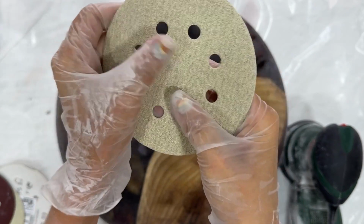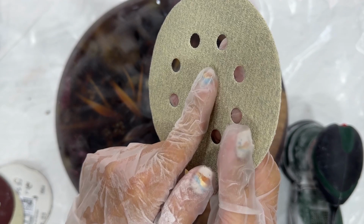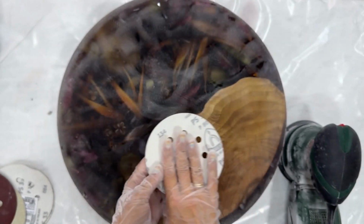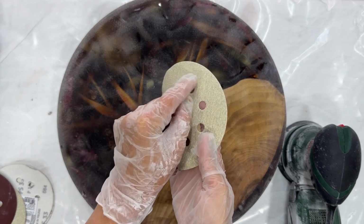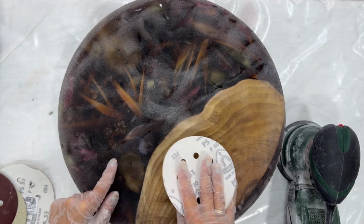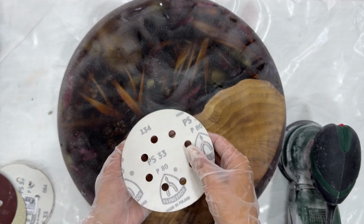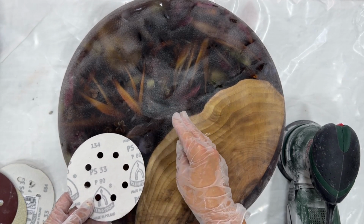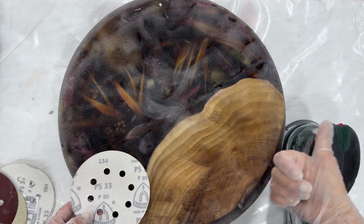Why do we do this? If you have a cheap disc, the grains that are sprayed here chip away when our machine starts moving on its own. It tears off when our machine goes along its trajectory. The torn grain also begins to create its own pattern, but much deeper because it's under the emery sheet. As a result, more scratches appear, which should not be there with this grain and which won't be removed with the next finer grain.